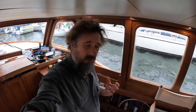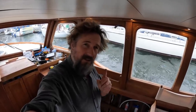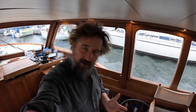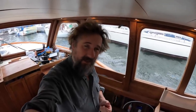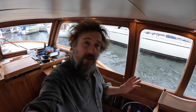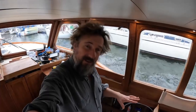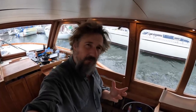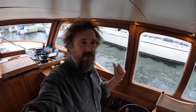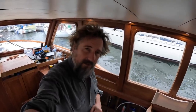They're actually quite small. They don't really lock when you twist lock them. And I do want to point out that there is another plug. Is it a better plug? I don't know. It's called the smart plug. It was designed to alleviate some of these problems, and I'm not a proponent of it. I have nothing to do with them. There's one on MV Zephyrus, and it's been running flawlessly. They're expensive, and they still only solve the problem at the boat end. It doesn't solve the problem at the marina end, because 30 amp twist lock is ubiquitous in marinas.